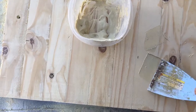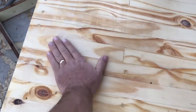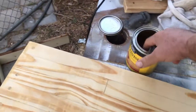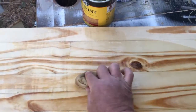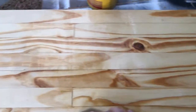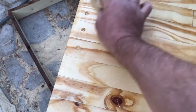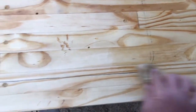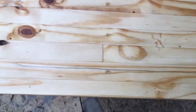We take a little bit of that and fill in the holes. As you can see, it's the same color and it's going to turn out real nice. Basically, we have hours of sanding — we got this nice and smooth, looking real good. We already stained it once, and now we're going to stain it again. The method is just grab a rag, get a nice amount of stain on there, and spread it out — they call this a French wrap or French polish, I forget the name. You just take a rag, dip it in your stain, and rub it around to get a nice layer on there.